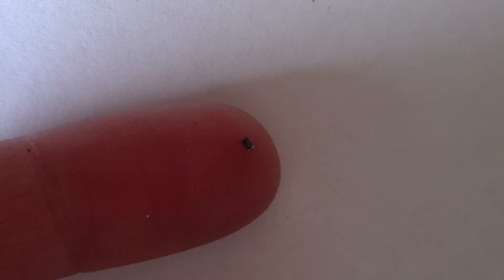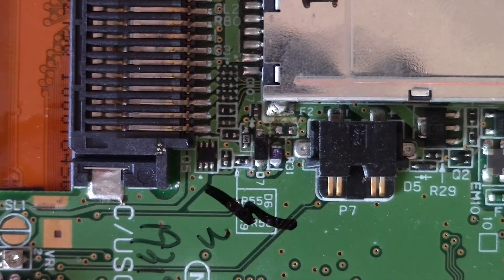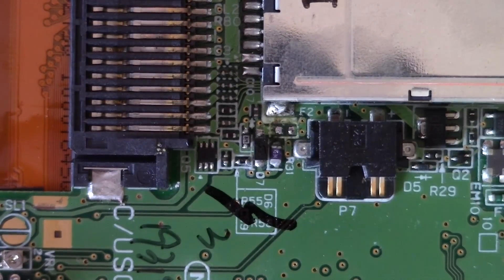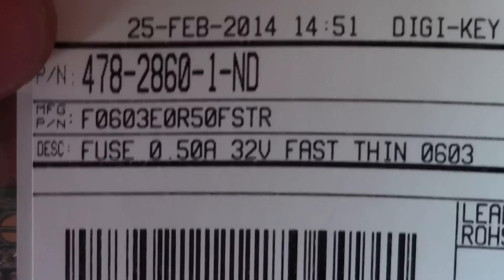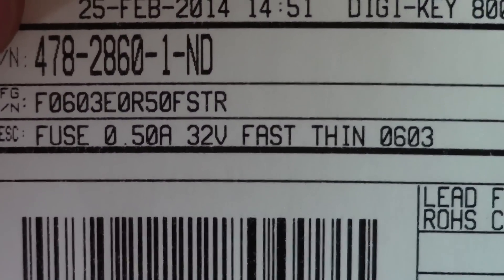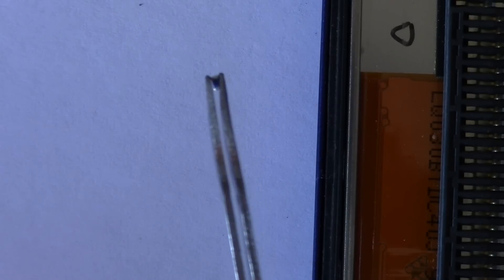There it is in relation to my fingertip. What's nice is it doesn't look like I damaged the board — a couple of little marks there from the flux, but I didn't lift any traces and I didn't lift any solder on any other components nearby. That's what I always worry about. So the next thing I'm going to do is put a little bit more solder back on those pads. Now, here's our baggie of teeny tiny replacement fuses. If you're going to go out and buy fuses, what you need are these guys — 500 milliamp, 32 volt, fast blow, 0603 package. These are very, very tiny. This is our brand new replacement fuse.